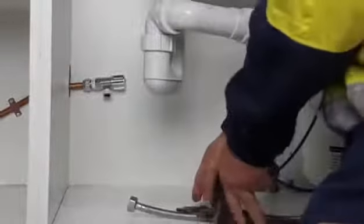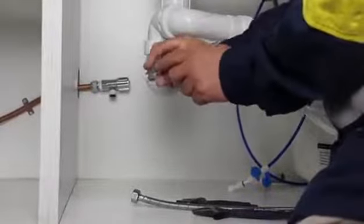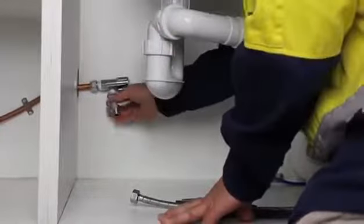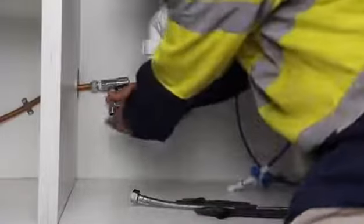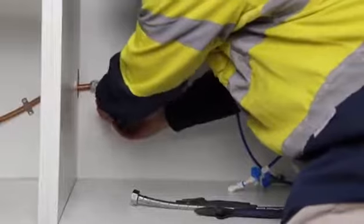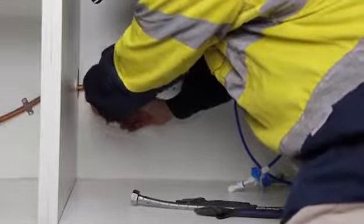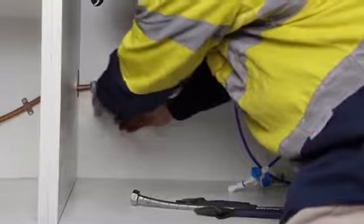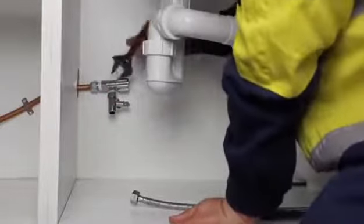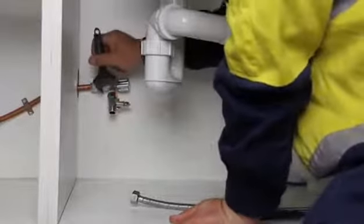Next, the 3-way shut-off valve goes inline in between the valve and the cold water line. Put the rubber seal inside the inlet of the 3-way shut-off valve, and fasten that end to the water supply valve by tightening the connection by hand. Then by wrench for a 1/4 turn clockwise further. Please don't over tighten it.